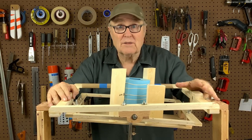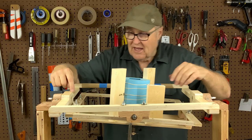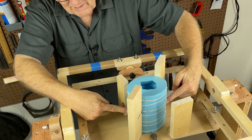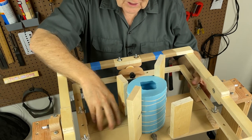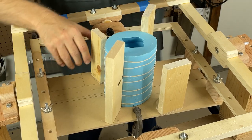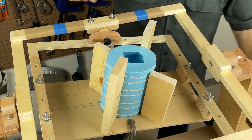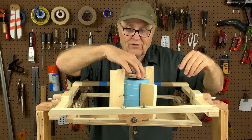The most important thing by far is making sure the whole thing is balanced, because if it's not balanced it's just not going to work. This frame can carry a substantial amount of weight, but it has to be well balanced. The center line of the main rotation has to hit right about the center of the mass of the mold — the mold is obviously the heaviest part. The cradle itself, the thin wood and blocks, don't amount to much in added weight. Then I have these stanchions that swivel into place and are simply tightened down, which has proven to be surprisingly effective.